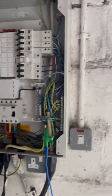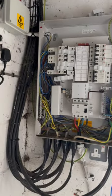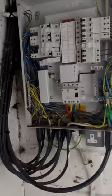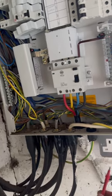We've just installed a TT earthing system on this board. We're in a stables at the minute - it's fed from over there and this board does these stables. It was connected to the PME earth, so we've just basically disconnected the armored cable.